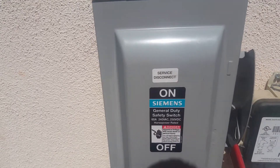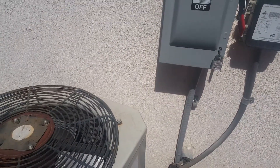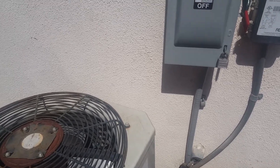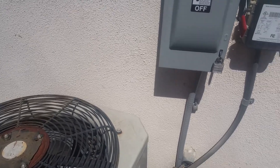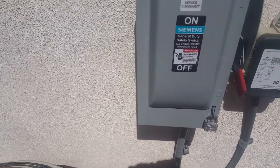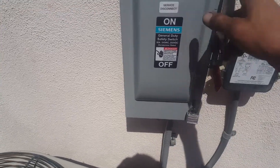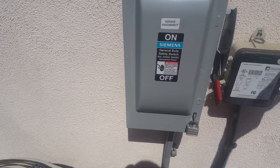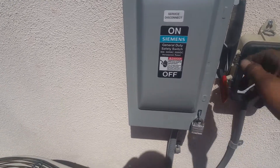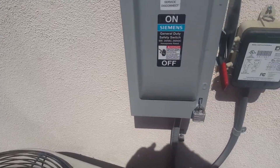Home Depot doesn't currently carry a 60-amp version. This unit is rated for a minimum current of 31.6 amps. Add 25% to that for fuse sizing and you get somewhere around 40 amps. This whole line is set up on a 50-amp breaker, so if you put 60-amp fuses in the box with a 50-amp breaker, which is going to trip first? The breaker. So 60-amp service — this is all set for 60-amp service.